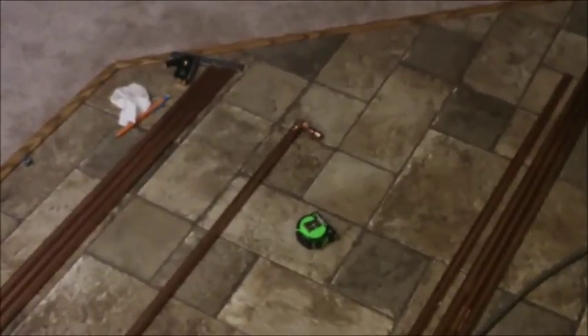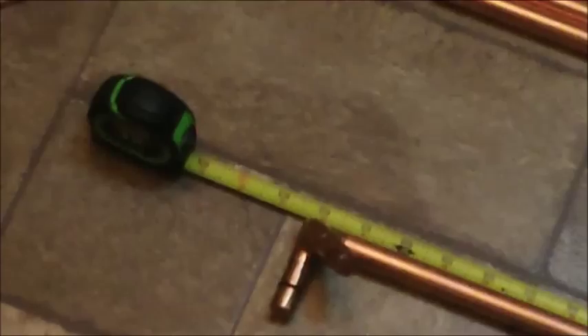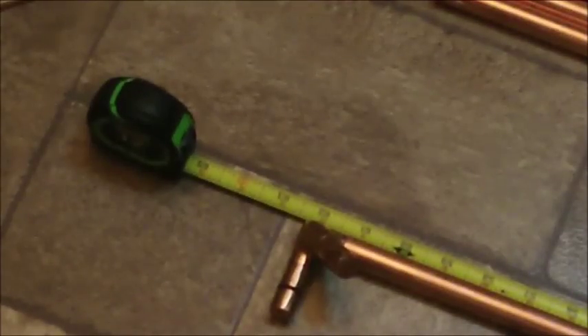Now I have both corners on — there's one side and there's the other side. It has to be measured not from the pipe but from this edge to the other edge. Measuring that full length, it's 62 and a quarter inches. After putting that in the calculator, the sloped edge turns out to be 59.2 inches, and that makes it 39.6 inches from the base to the apex of the triangle.